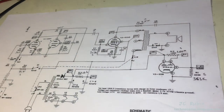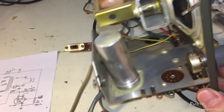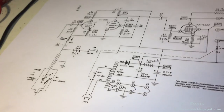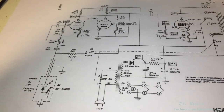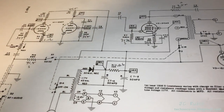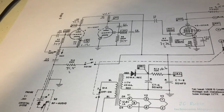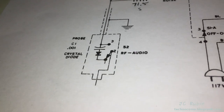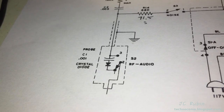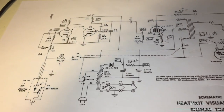I've gone through all the resistors in the unit and they've climbed a little bit but nothing outside of specification, so at this time I do not plan on replacing any of these resistors. The only other specialized testing remaining will be for the diodes and capacitors. For the diodes I'd be interested to see what their trace looks like on the oscilloscope, so I'm going to do that for the selenium rectifier as well as the simple diode that exists in this unit. That should be pretty interesting. So far things are looking good for this unit.